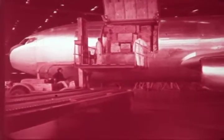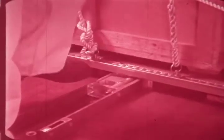Inside the aircraft, palletized cargo is restrained on the rollers by pallet-spaced stops and side rails. No other tie-downs are required. Now properly positioned with respect to both the airplane and the truck, the staging, on which are mounted standard roller conveyor units, is raised for the first pallet in the aircraft doorway. And as it is leveled, the pallet locks in the doorway are cleared, and the stops at the forward end of the ball transfer unit are cleared. The pallet is then moved by the man on the staging over the ball transfer unit and is positioned on the staging where it is held by stops.